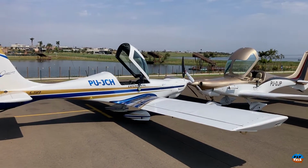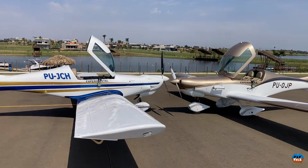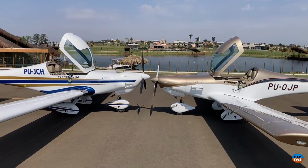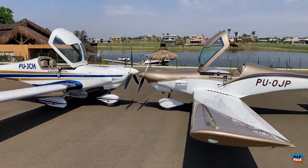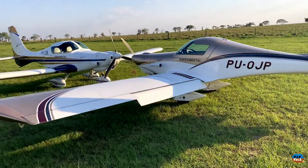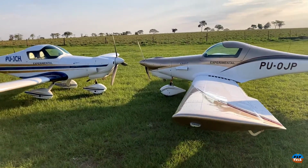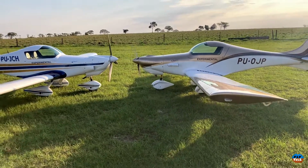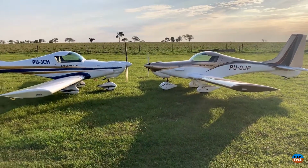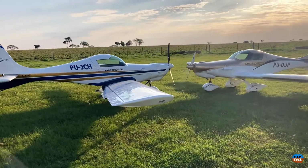For our comparison, we'll fly the Jabiru powered Quasar first. The Jabiru 2200 engine weighs a few kilos less than the Rotax 912S, according to the manufacturers. But since the carbon fiber fuselage in the Rotax powered airplane we flew is a bit lighter than the fiberglass fuselage in the Jabiru powered plane depicted here, both planes have basically equivalent masses. For both flights, we had around 15 gallons of fuel and 2 adults on board. The flights were performed in sequence, with temperature and wind conditions practically unchanged.